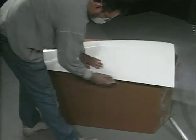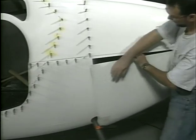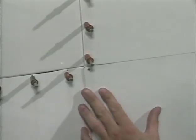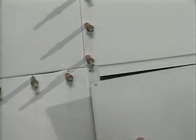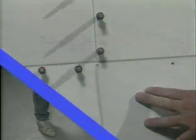Continue drilling and fitting panels. As panels are being fitted, Clecos can be moved and edges trimmed as necessary. Check that the four seams in this area come together at the same point. If they do not, a file or wood block wrapped in sandpaper works well for precise trimming and fitting and will leave a smooth finish. Sand or file away a little at a time.